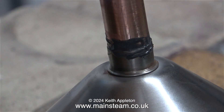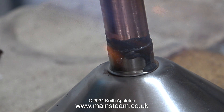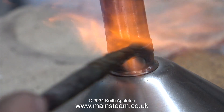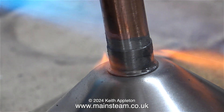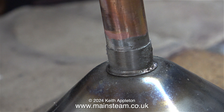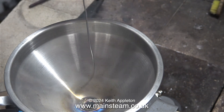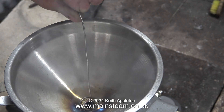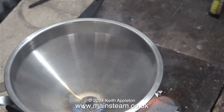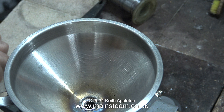As usual, I applied far too much solder, because I need to show you what happens if you apply too much — it runs all over the place, like this. But it's not too bad, because once I've finished this job I will clean it up in the lathe with some emery cloth. As you can see, all of the flux has been cleaned away, though the finish isn't very good. I'm also using electrical solder on the inside edge of the copper tube where it meets the stainless steel funnel. I never fully trust solder paint, because I have had it let go in the past, so I always use too much solder. Now the funnel and the piece of copper tubing is extremely hot, so I just have to wait until it cools.